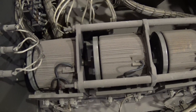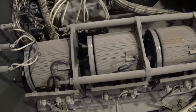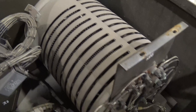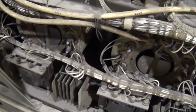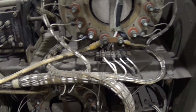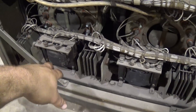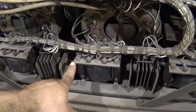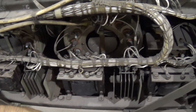Let's take a look on the inside. Here's that three-phase rheostat — they're just ganged together. You've got heating elements wound around the fan here, and all the different taps for them. There are three sets. Here's the second one, third one. You've also got three input control transformers, primarily there for the fan control — I'll show you that in the diagram.